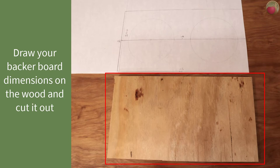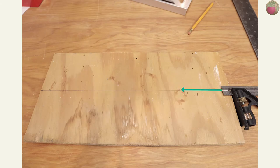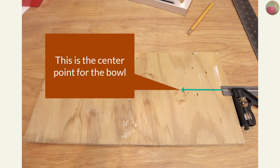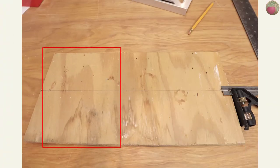Now it's time to recreate your drawing on wood. Cut your board to the dimensions you measured. Next, draw a center line down the middle of the board lengthwise. From the end of the board, make a mark for however much edge you want from the end of the board to the start of the bowl circle — this will be the inner part of the bowl, not the outer part of the bowl's lip. Mine was three-quarters of an inch. From that point, mark the radius of the circle on the line — this will be the center point where you'll drill a hole for your circle-cutting jig. See my tutorial for the easiest DIY circle-cutting jig for your trim router for details. Repeat these marks on the other side for the other bowl.